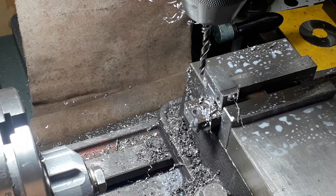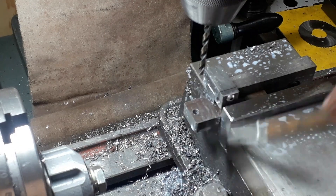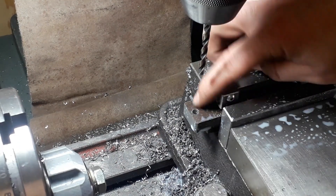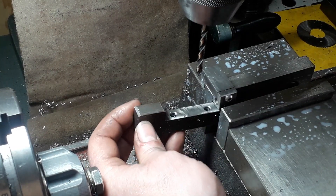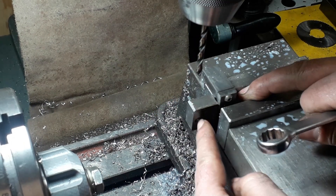The whole thing was made out of bits of scrap lying around. What we're utilizing here is the stop on the vice to drill this other hole for the little grub screw to go in. So you can see — we remove it, and we've already machined the L-shape, if you will, that just stops there.